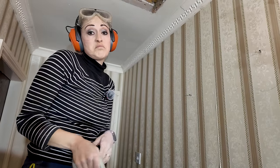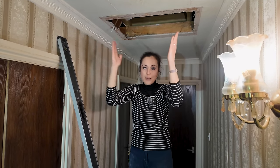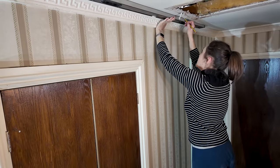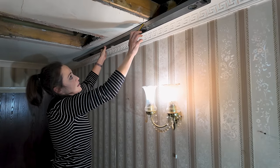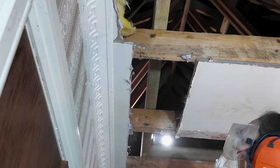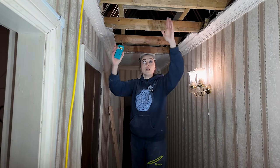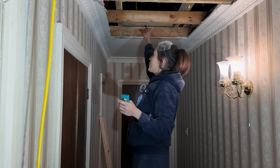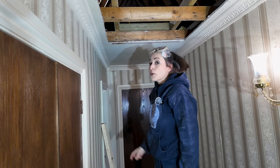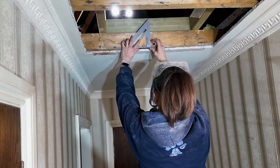I realized I had to strip more plasterboard than I wanted to - it turned out the plasterboard was nailed to the hatch itself not screwed. Once I've removed all of that, I want a better visual so I can get the loft ladder absolutely central to this room. I'm going to hold up a straight edge - a very long spirit level - up to the coving and draw a line along it to the next joist, then cut and do the same on the other side. Getting central: 47.23 - roughly there, but it's really cold up here now.